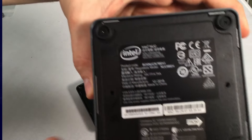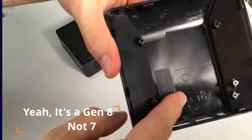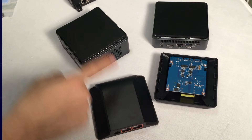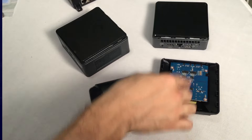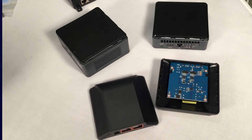Flip it over and check out the part number. Find the first letter 'I' — the number before that is the model number you need for the lid. In this case, I have the 7. Simply check whether the underside lid is labeled with the same number — 7 or 8. If you have the wrong lid on, no problem: simply unscrew the board from the lid and screw it into the correct lid.